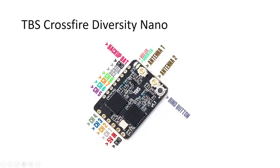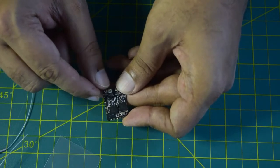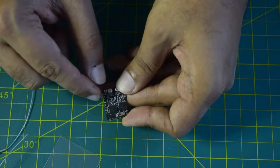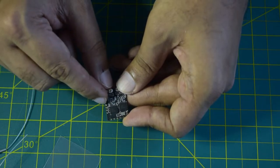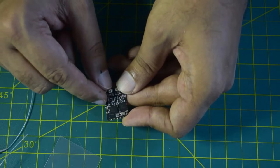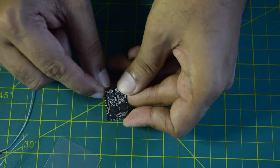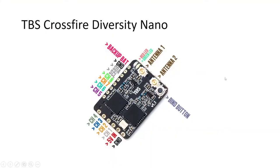So this is a serial port which you can use to connect a magnetometer or any other peripherals that use serial communication or I2C communication, or SCL and SDA, which can be connected onto the next two pins. And the last two pins, guys, here you can see, are for battery connection, for battery plus and battery minus, so as to be able to power it separately.